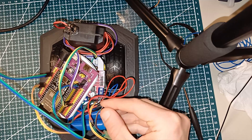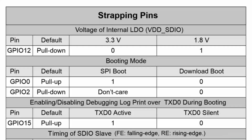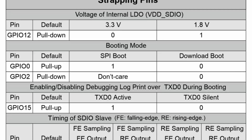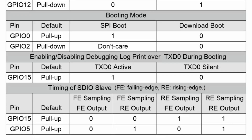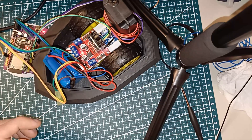Code modification was not too difficult — I took the relevant parts from my remote-controlled smart spider robot project. One thing that surprised me was that on switching on, the Dalek would start spinning crazily. It turns out the ESP32 has quite a few so-called strapping pins that are pulled either up or down during boot. If a pin is pulled up on boot, this causes the motor driver to give current to the motor and off it goes. The solution: if you have enough pins, simply don't use those special pins.